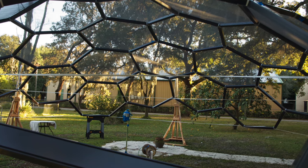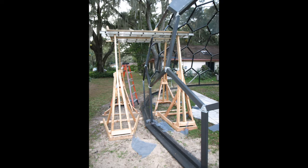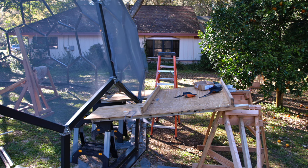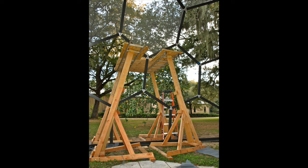As the dome approaches the second and third ring of faces or panels, the need for more supports, also described as jacks, will arise, as it is important not to stress any portion of the structure as it grows higher. The pictured custom scaffold jacks can be made out of two-by-fours and two-by-sixes. They allow easy repositioning during lifting and, with the use of heavy bungee cords, help distribute any weight to the other bungee cords on the remaining jacks. They can be positioned horizontally or vertically and act as supports for a platform.